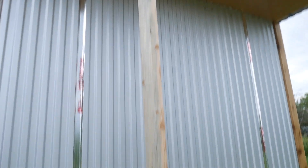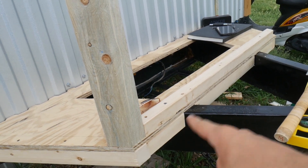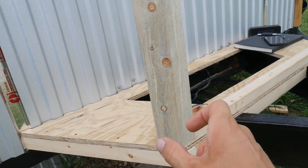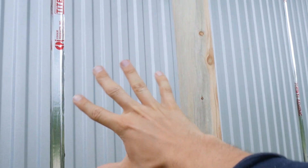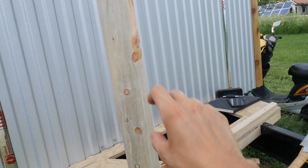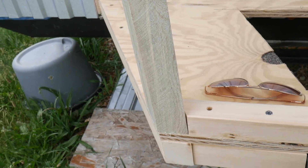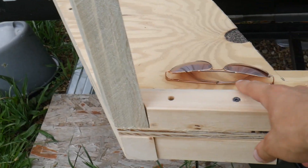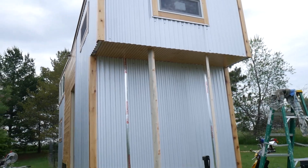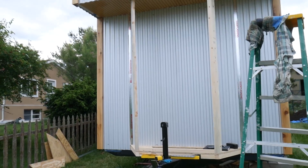Here's the first piece — I puzzle-pieced it so it fits in here, and I'm going to do that all the way around for a nice structural element. With a bit more work, I've got one of the posts standing there to see how well it fits, and the piece on the bottom and top feels really strong. The left piece of sheathing will attach to the center part here, which is actually going to be a door hung on hinges, so it doesn't need to be fully supported there. I made sure I had a screw that goes all the way down into the other piece for a really nice clamped, stronger beam.